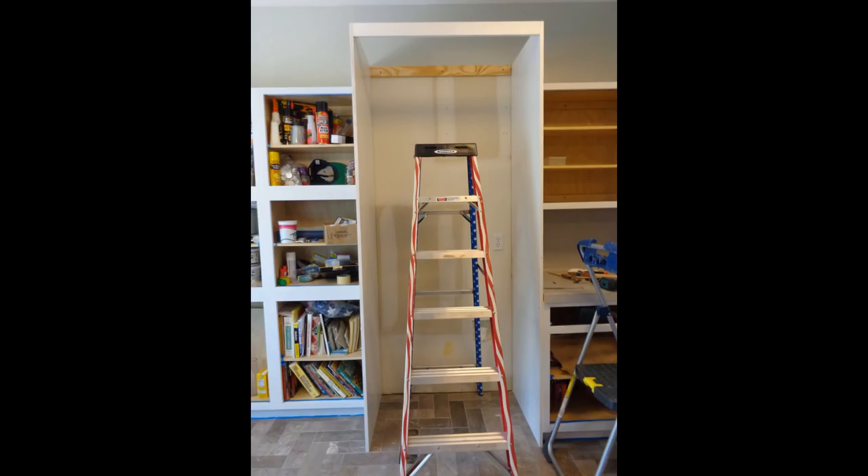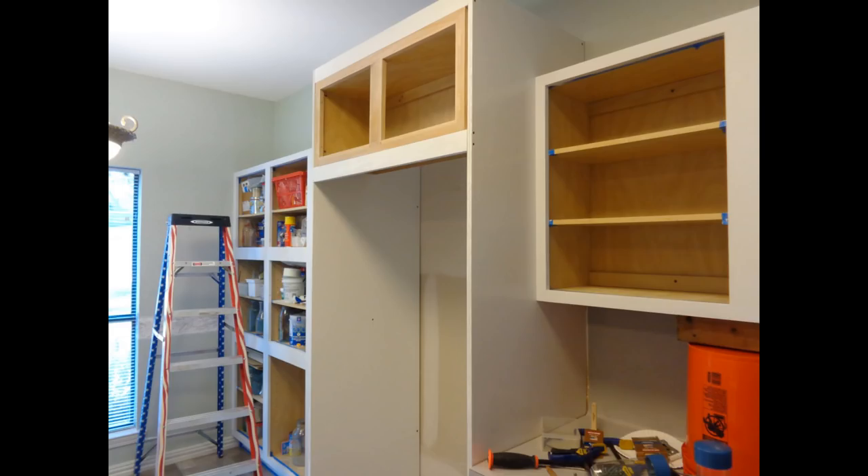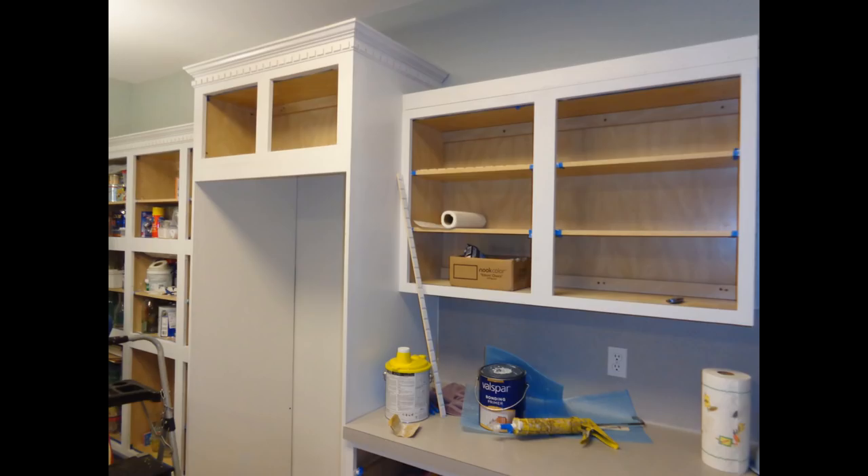My husband started building a new refrigerator cabinet from a 4x8 sheet of plywood cut in half, which we had pre-painted before installing. He built the top of the cabinet from an upper cabinet across the room that was to the right of the wall oven. He made the refrigerator cabinet 6 inches taller than the other top cabinet to add height to the room. The refrigerator cabinet has excellent air flow on the top back section since the top cabinet is only 12 inches deep.